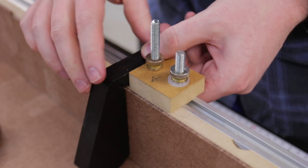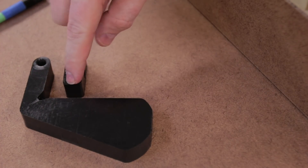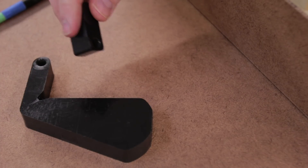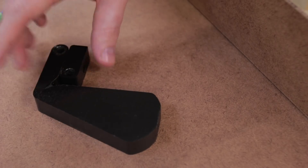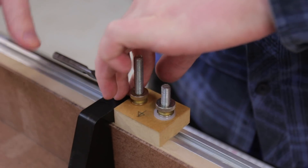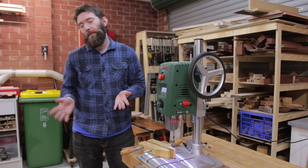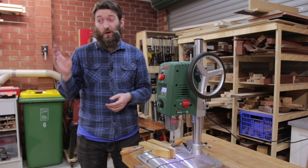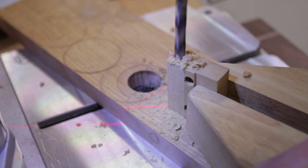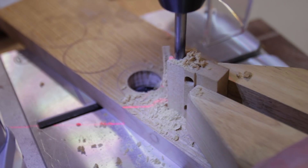The next issue to address once I remill this part is how to actually attach it to the flip stop portion. When I milled out the original version I could precisely place those holes in the block, then I had to drill the one that the T track bolt went through. Not a big deal for that one, but the others have to be relatively accurate to actually work. So I put this in place, get the flip stop arm, hold that in position, and I've got an 8mm brad point bit in — that gives me a point to drill. If I were making a whole bunch of these I'd make up some sort of jig or fixture to hold it on the CNC. I'm only making one or two prototypes, so a drill press with a handscrew clamp is actually a really easy way to drill this straight and safely.